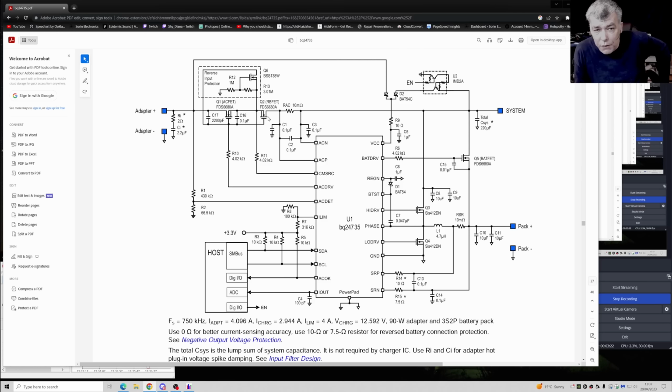And you can see both MOSFETs on the input. Then you can see here the switching power supply, which will charge the battery. Then you will see this MOSFET, through which the voltage comes back from the battery to the system, yeah? And then you will see here it is actually speaking with the I/O chip. And the I/O chip is speaking with the battery. This chip doesn't know the charging current. I'll repeat it one more time. So the charging current is coming from the battery. And this chip will switch this power supply and it will charge the battery. Okay? Pretty simple.